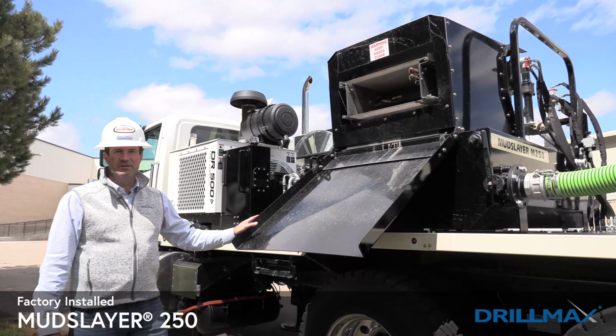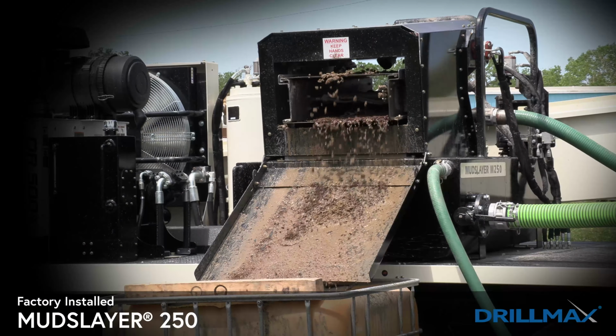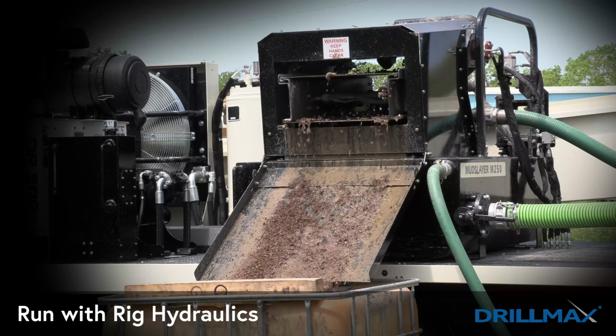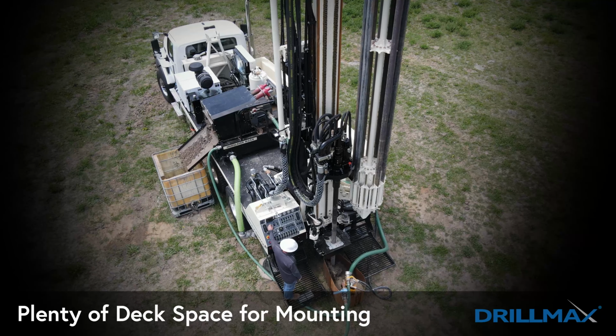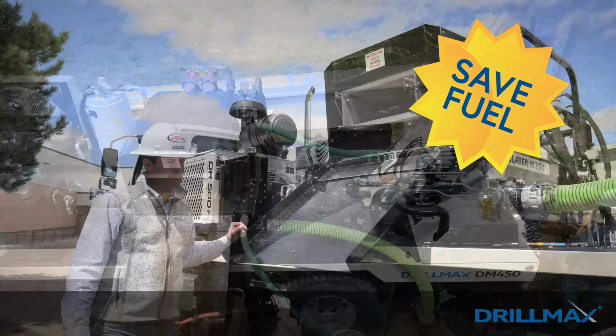This is the first time this has been done on our DM450. We mounted a Mudslayer 250 on this unit. There are a lot of advantages to having this on the unit. We're able to use our rig hydraulics to run this. We have plenty of deck space to mount this. So when you mount this on the rig, you're able to save fuel from the extra engine that you normally would have running a Mudslayer system.